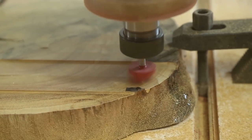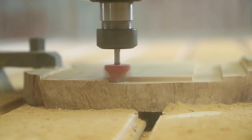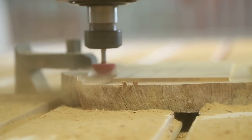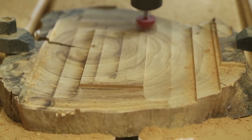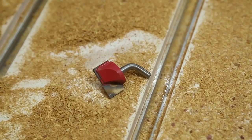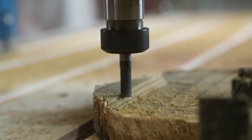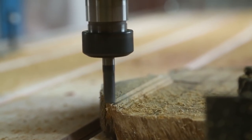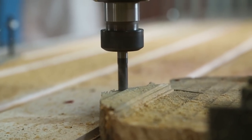The surface is really really nice and the wood router did a great job, but the problem was actually with the shank. The shank is too thin for this kind of job — this bit was supposed to be used with a handheld router, but I put it on the CNC machine, because of which it actually bent and it could have been a very bad accident, but somehow I stopped it in time. I started using a 10mm aluminium bit — a 4-flute one — and since aluminium is a harder material, using this bit with wood is no problem.